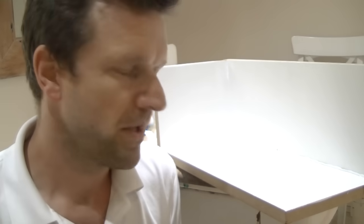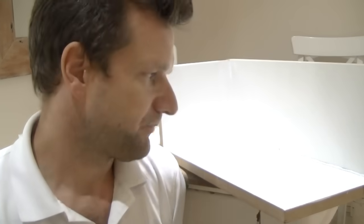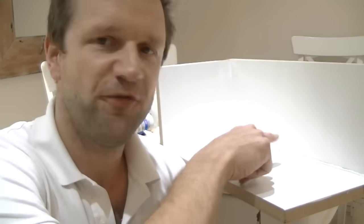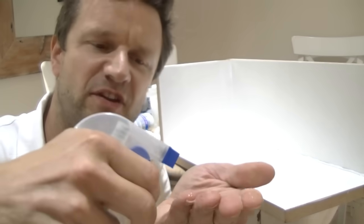But this is where my video becomes a little bit controversial. A lot of trade pros out there use a water detergent mix as a tooling agent, and they apply it at this point before they've actually smoothed the silicone. I had a guy commenting on my last silicone video and he got very angry and said I was a complete amateur because I wasn't using this water detergent mix. My point is this. The whole point of this water and detergent mix is to create a slippery, greasy surface that the silicone can't grab onto.